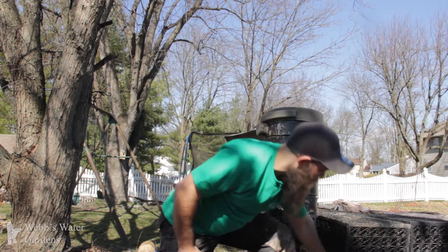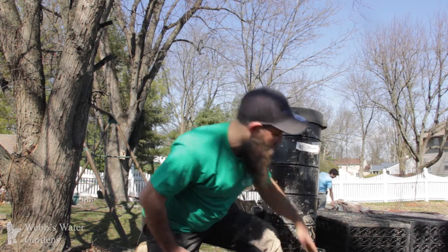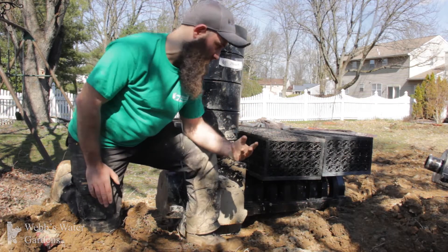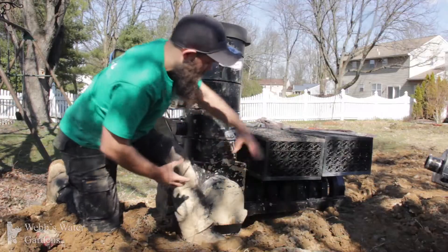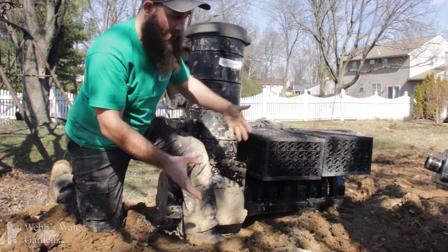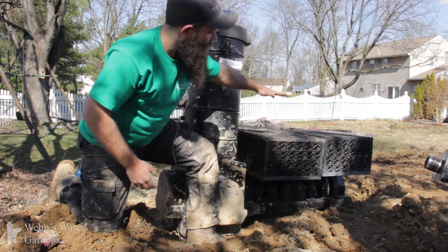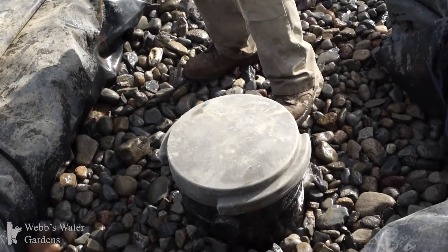We want the centipede to sit flush and flat so that the blocks above it can sit flat too. Water will rise through and make its way through the aqua blocks, and above the aqua blocks we're going to have three layers of gravel in three different sizes. First, a larger gravel — typically a minimum of five to eight inch stone — to encapsulate the products and keep them safe and sturdy in the liner. Above that, a layer of one to three inch riverjack gravel, and above that, three quarter inch riverjack gravel.